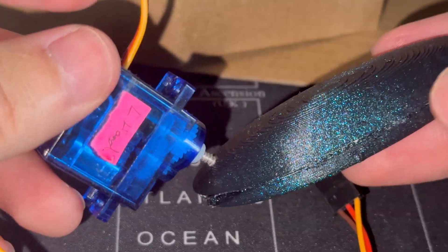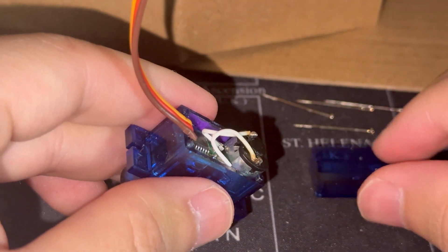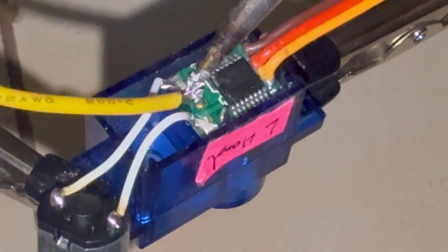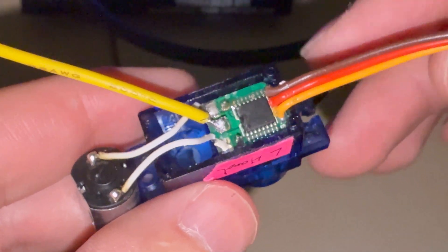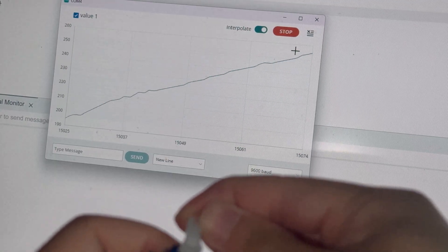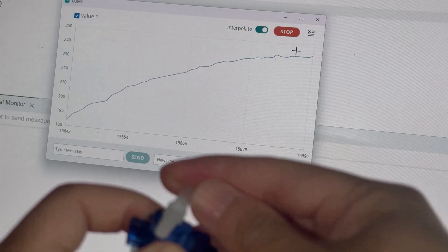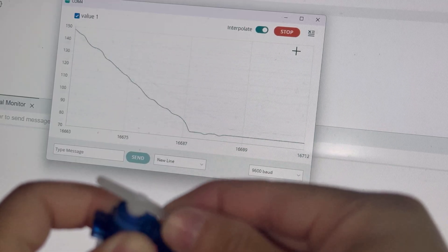Let's take off T-Bot's arm, remove the screw, and gut out the internal components so we can get the potentiometer. We want to read the middle pin, which is the potentiometer, so we're going to solder a wire to it. Once you solder it and connect it to the Arduino, you should be able to read an analog signal — just like this. And with a little bit of coding, we can map the angle to the volume of our PC, like this.